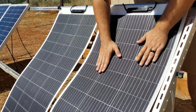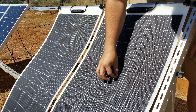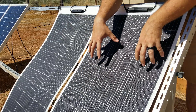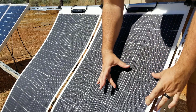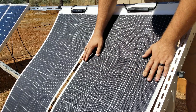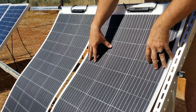The ETFE surface has a bumpy texture — you can hear it running your nails across it. Those bumps serve many purposes: the ETFE finish itself, but also the bumps act like little mini magnifiers for the light, which allows the cells to make more power and be more efficient rather than having a flat surface. Another thing special to the flex 100 panels is the number of bus bars — nine bus bars per cell — which means better power production. That's something you don't see in many other solar panels, where you may only get three or four bus bars. That's one reason why the flex 100s are my favorite flexible solar panels on the market.